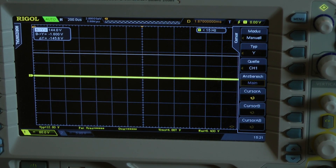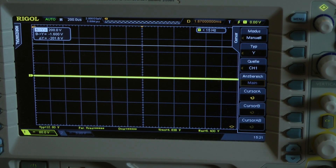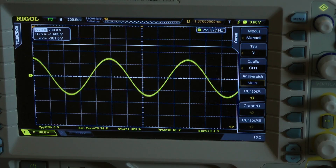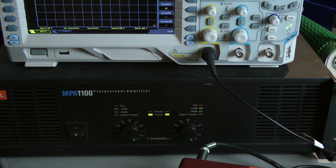I'm doing a 2 ohms per channel test to see if the amplifier likes 2 ohm loads. The spec says 4 ohms minimum per channel. It's limiting — I go back — now it goes high again. No chance at all. The protection circuit is coming in and limiting the output power when driving a 2 ohm load per channel, both channels driven.